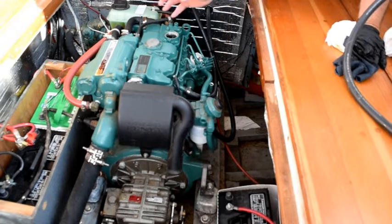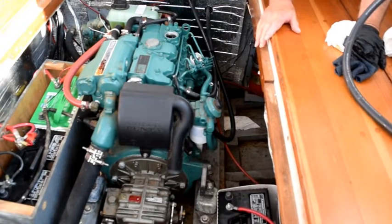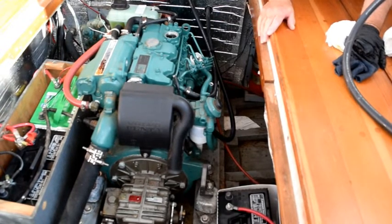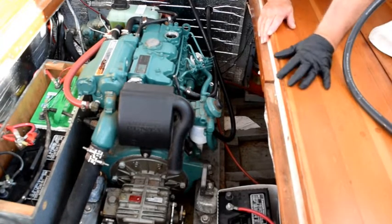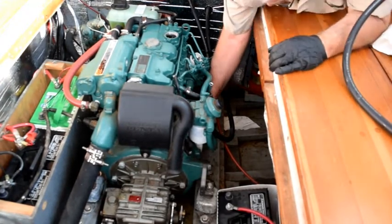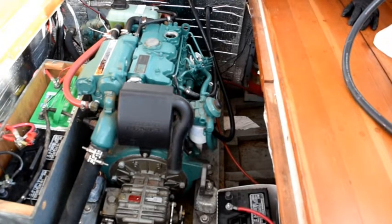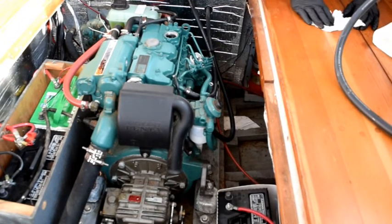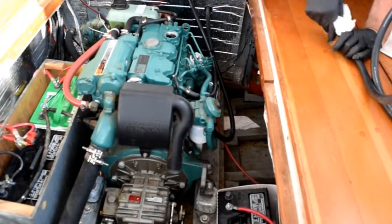Now that we've got it opened up so air can go in as the oil drains out, I have to drain the oil out. This engine is very low in the boat, and it would be impossible to get underneath it to just pull the pan drain plug and drain the oil into something. But fortunately, instead of a drain plug, the engine has a tube plumbed into the drain plug fitting. It's right down here, a little hard to get to, but it's got a rubber cap on it that you pull off. I have here an electric oil change pump, which will just pump the oil out. So I'm just going to wipe off the hose here a little, just to make it a little easier to handle.